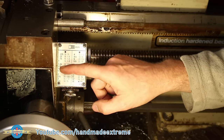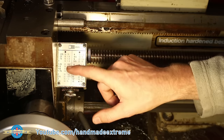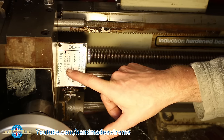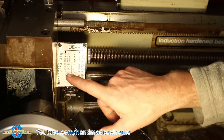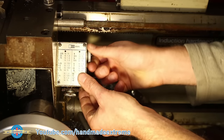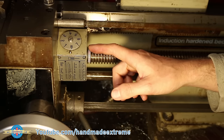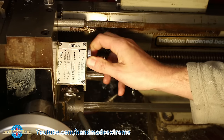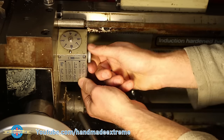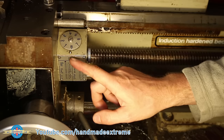To cut a 1.5 millimeter pitch thread we need the gear with 16 teeth. There's a little number here — in this case numbers 1 to 8, then 1, 3, 5, 7 on the next one down. Don't confuse it — it's not 15, it's 1 and 5. What that means is we can engage the threading by switching on the half nuts using any of the numbers 1 to 8 when they line up with the little dimple.